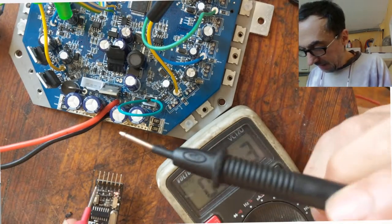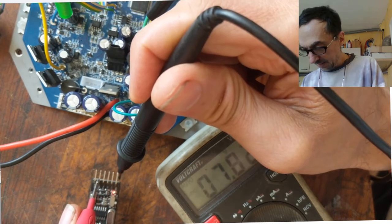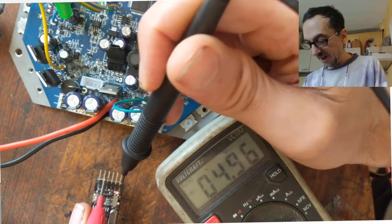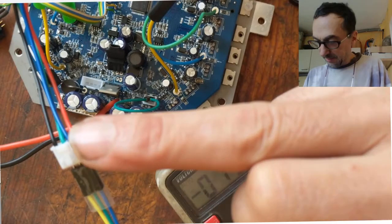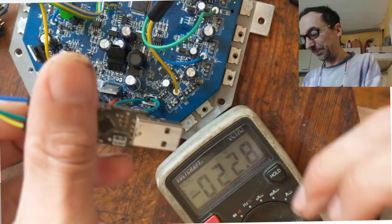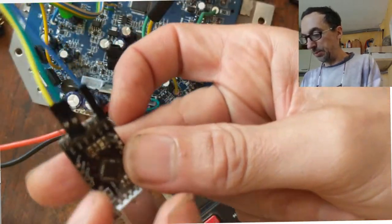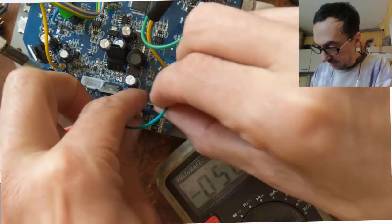The RX pin has a pull-up open, and the pull-up is done by this dongle — it's ground to pull-up and it's 4.9V. If you switch the jumper to 3.3V, the RX pull-up is still open. The 5V is okay if you use the short serial cable, since the STM32 is 5V tolerant on that pin. This dongle actually outputs 3.3V.